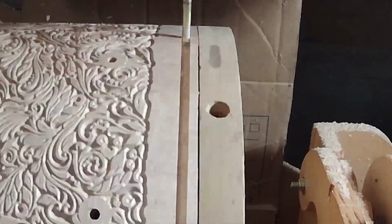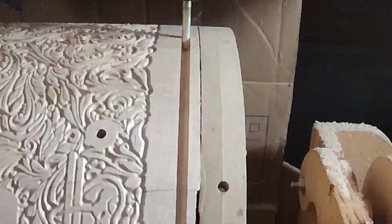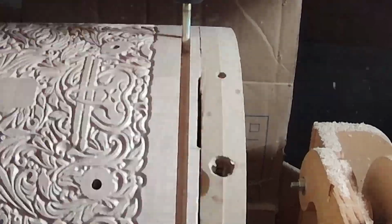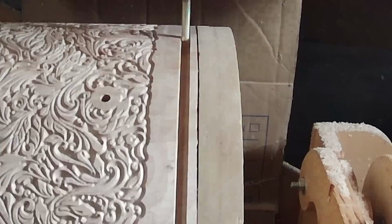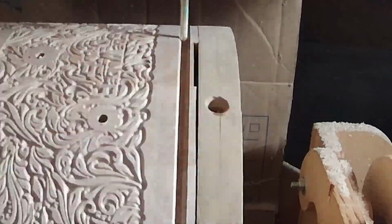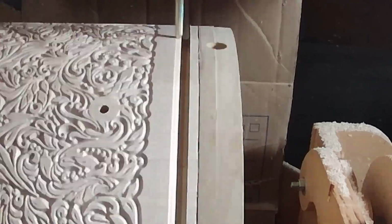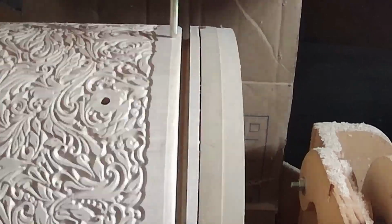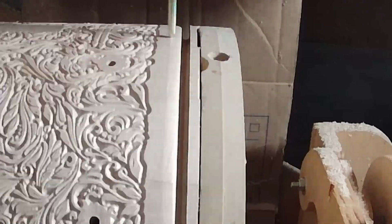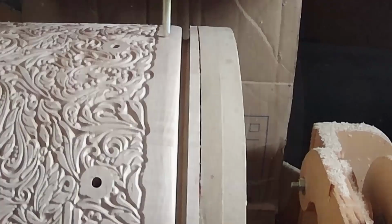The next step in the process is putting the bearing edge on the top of the drum. I talked about this a bit in the design software. The first part of this, it will drop down a ½ inch, create that pocket. As the bit raises up, it'll start moving to the left, given that compound radius that I talked about too. And the bit I'm using here is a 1/4 inch ball nose. It's also made by Cody over at Cadence Manufacturing. This one's called the Jenny Big B.